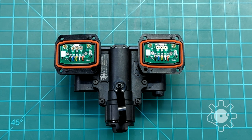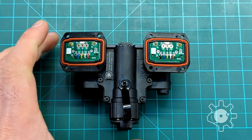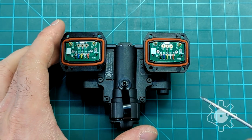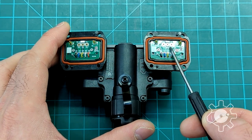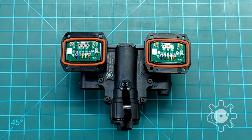The easiest way to get gain control is to just use 10160 variable gain three-pin tubes. What we do is use those tubes and get the third pin installed where it's labeled P5 — a short pogo connector — that will make it so that manual gain is just drop-in. You plop the tubes in and you have manual gain.